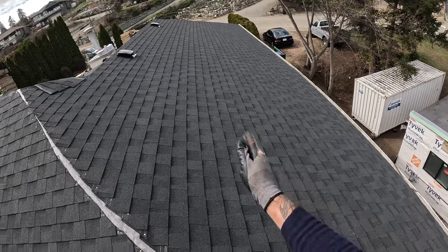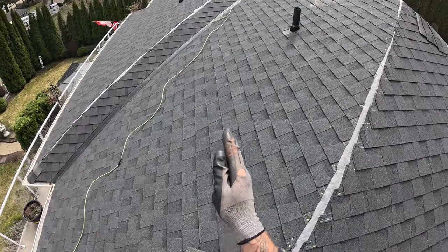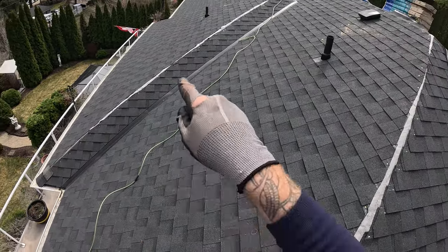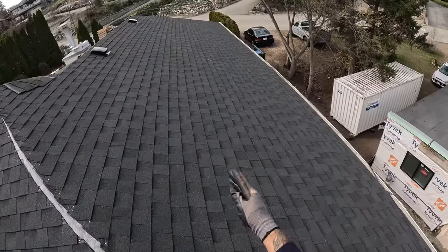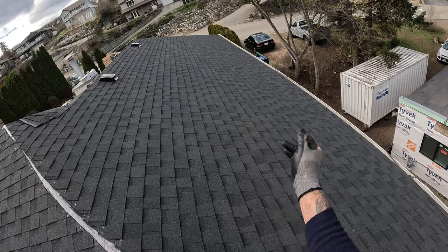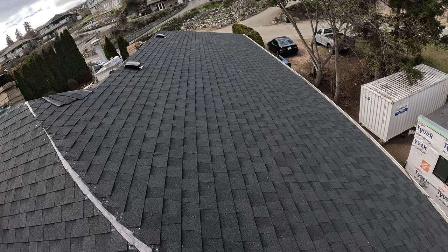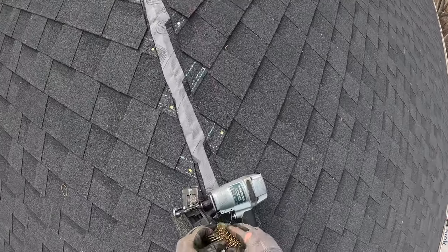Yeah, this wasn't, like I said, the eave on this one when a buddy did this. But if you look down mine, everything is perfectly straight, because I catch it early on in the first four rows. If I find the eaves really out, then I run a chalk line. He just trusted the eave and then went up, so you get a little wave, right? But it's fine. It doesn't do anything to the roof. It just personally doesn't look good enough for me.